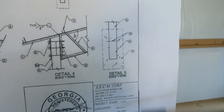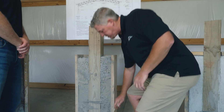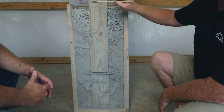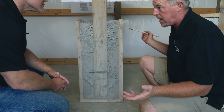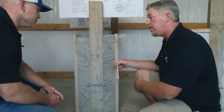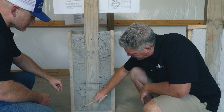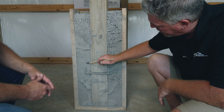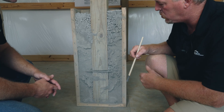This is a half-cutaway of an 18-inch by 36-inch diameter pier hole. What we did here was pour the dry concrete in and then flood it — saturate it with water from the top — until water ran over the sides, to simulate rain or someone pouring water over the hole after backfilling with concrete. A lot of it is hard in various places, even down at the bottom. But you still have some areas where, as it locked up on top, it couldn't quite reach certain spots — this feels just like dry concrete out of the bag.